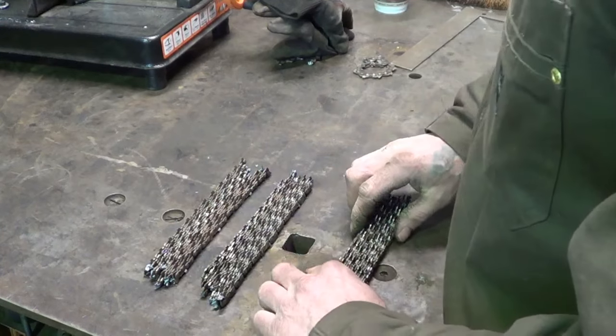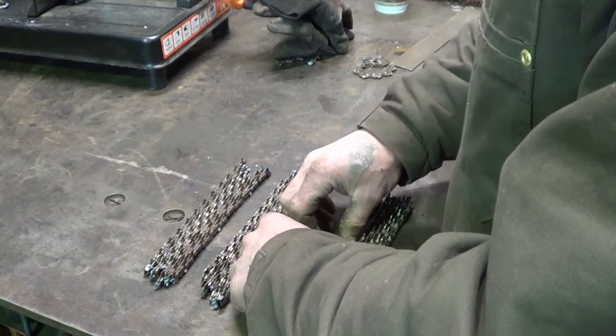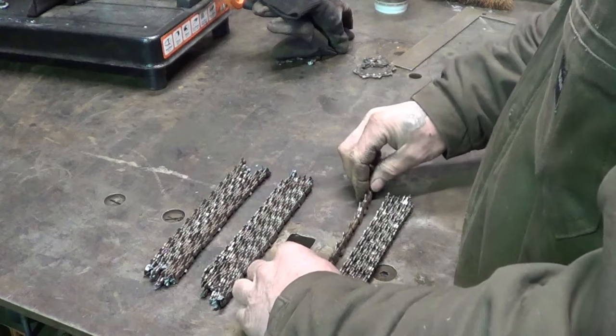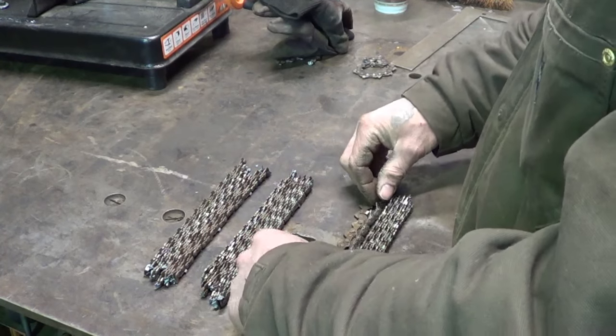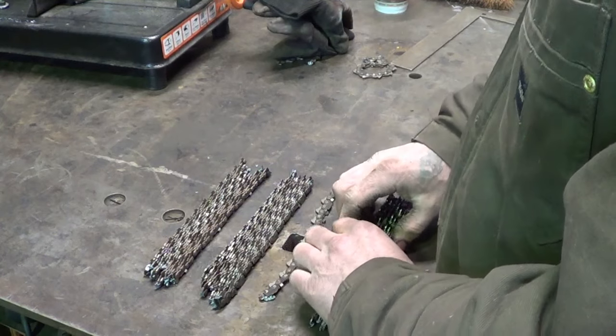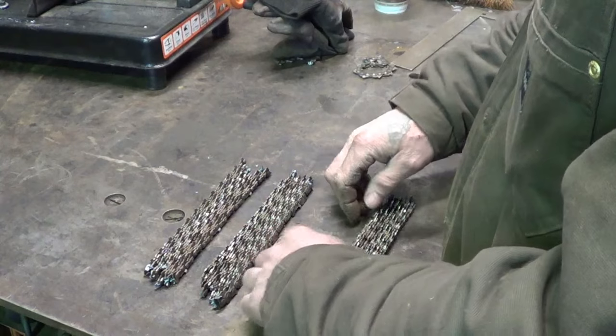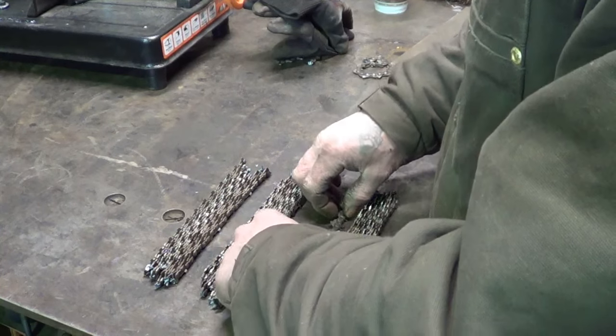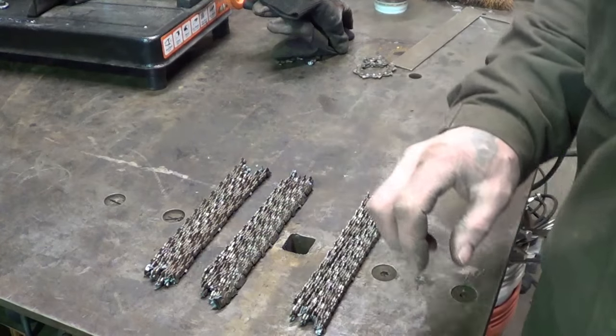We'll weld them up, and then we will weld them together. Now these things are pretty damn dirty. I probably should have soaked them in some vinegar or something to clean them up a little, but we'll let the fire and the borax do what they can do, and we'll see how it turns out. I bet you we'll be just fine. Alrighty, let me get these welded up.